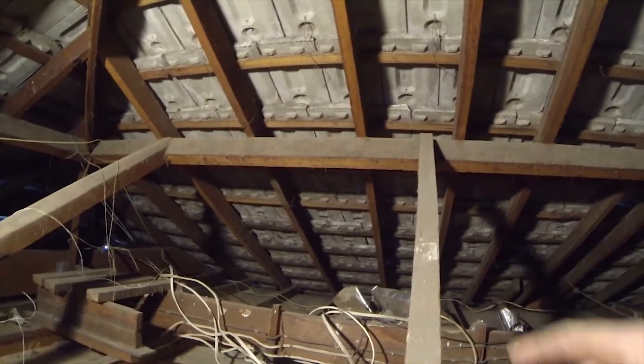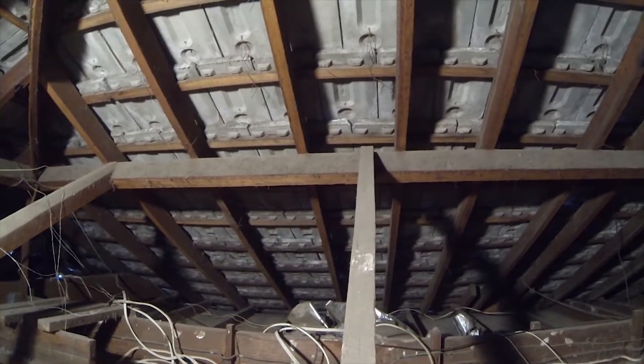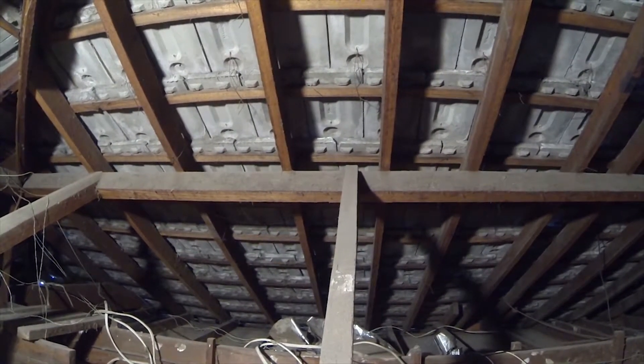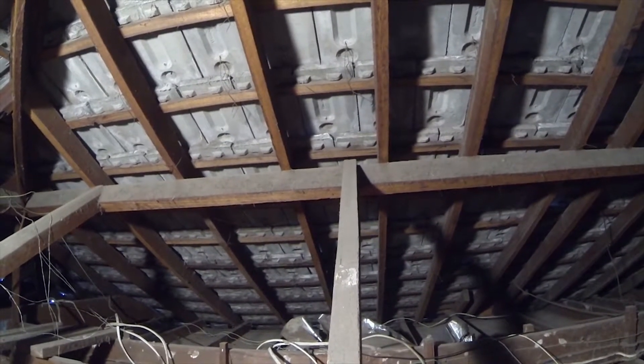Today we are looking at a roof that is tiled and it's a pitch and prop — so it's pitched and then it's propped. The roof itself is pitched with what would be a 100x50 OB, ordinary builder. Now it's dried out it'll be round about what we call a 4x1.5, or 100mm by 35mm. It's shrunk into size.